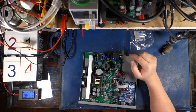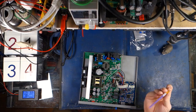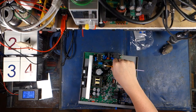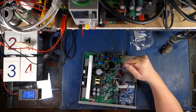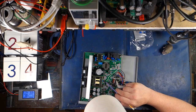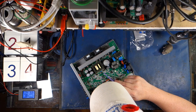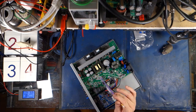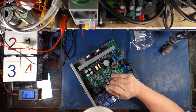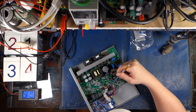Look at this board. Let me use this purple paintbrush as a pointer. Here's the AC section right here. It's an international standard that better power supplies have actual physical isolation between the AC and the DC side. Right here we've got a cut, a coupling capacitor, and possibly an opto-isolator. This is the DC side bridging it across. There's actually a cut in the board here to ensure we don't have any AC bridging — a nice fat gap right along here.